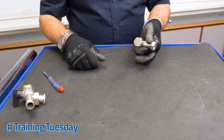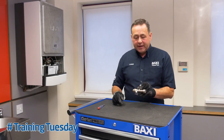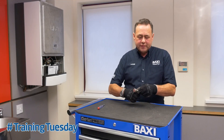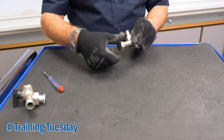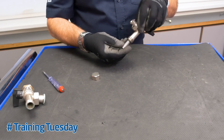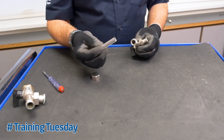There is a similar filter on the cold mains isolation tap. To remove that, isolate cold water at the tap, open a hot tap to relieve the pressure, remove the cap and remove the filter. If that's blocked, it will affect flow rates to your hot taps.